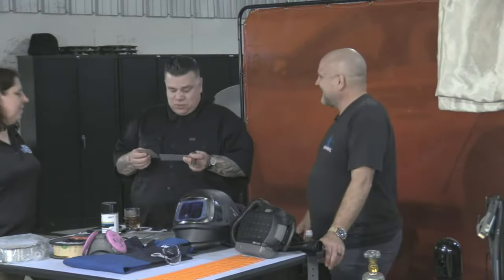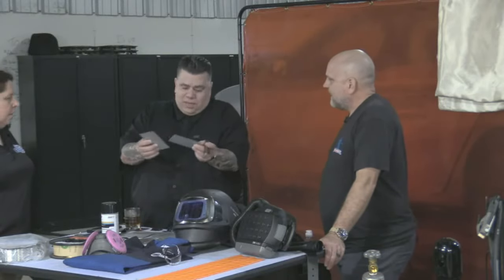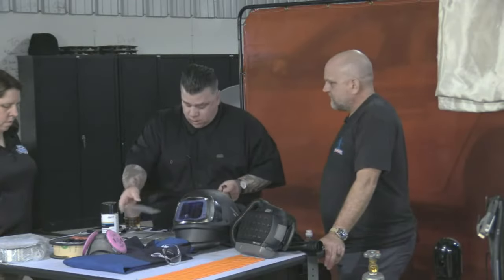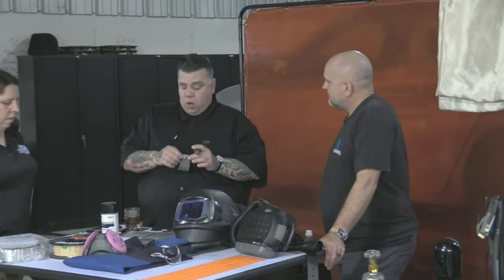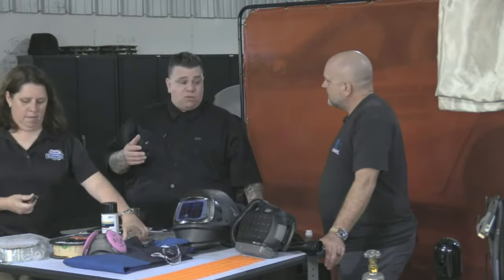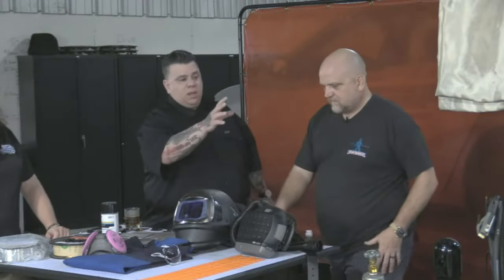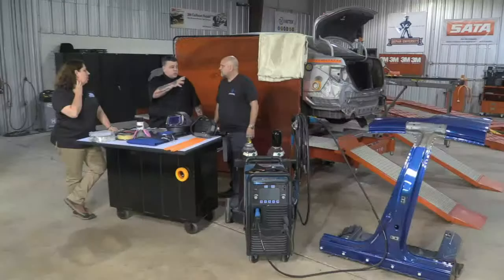We asked our I-CAR instructor, the welding guy in the area, where do you get them from? He says, here's the address, and you can order them. You get these coupons, they're great for normal practice. But when you work on the car, you have to weld with the same type of material and thickness you're working on, which sometimes can be a part from the vehicle that you're cutting off, or in some cases you might have to buy a used or salvage component to have in the shop